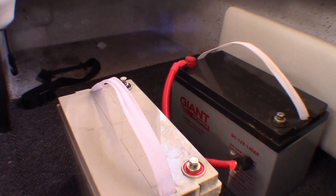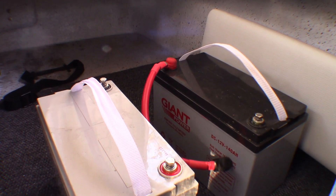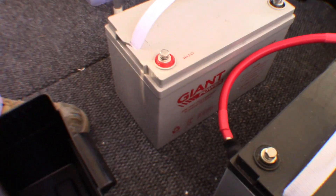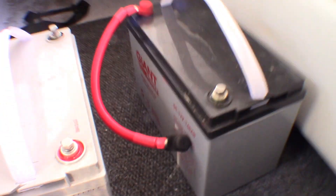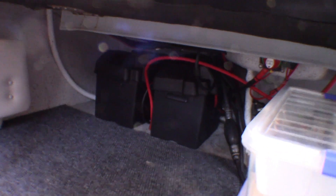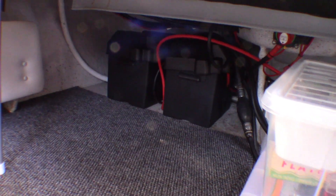Here are my batteries that I'm going to use for the Minnkota. I've had these batteries about a year — been a great battery. They're an AGM battery and I'll put a link in the video in case you're interested in getting some for yourself. Really deep cycle 140 amp hour batteries. I've used the Minnkota extensively and I haven't managed to flatten them yet. These are a 24 volt system, and whereas on the 12 volt system everything's connected positive to positive, negative to negative so they're in parallel — on the 24 volt they're wired in series.